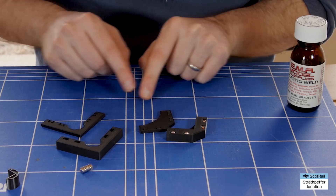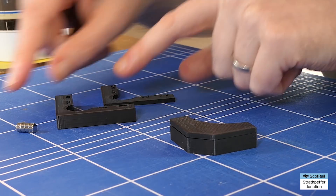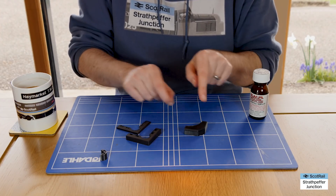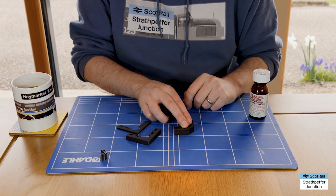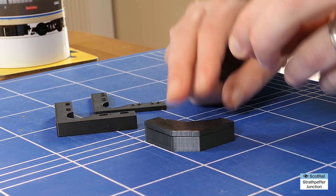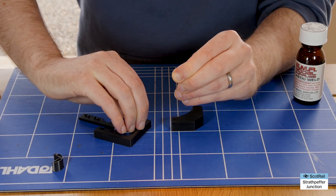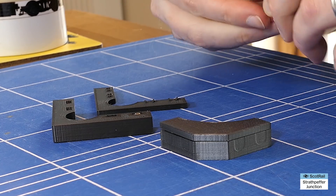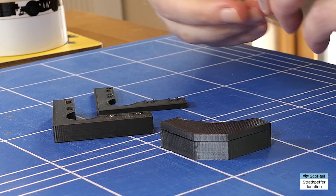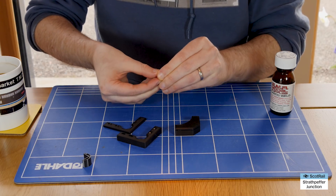So that's all these ones in fine, and I'll just do a quick dry fit - pop the lid on it just like that. Now we'll move across to sticking the magnets in the other one. The key point is we have to get these magnets the opposite way around to how they are in this one. The way I tend to do that is just let them stick on the outside like that, then take it off, hold it like that, carefully peel the magnet out, and then slot it in. It's probably easier to do this in practice than to explain, but if you get it wrong, do a dry fit, test it - if it doesn't work, lever them out, spin them round, and stick them back in again.